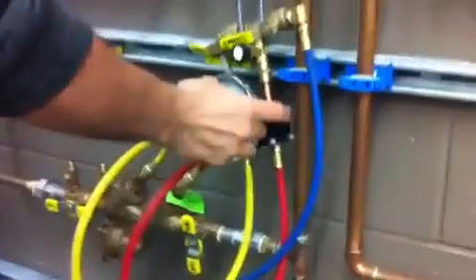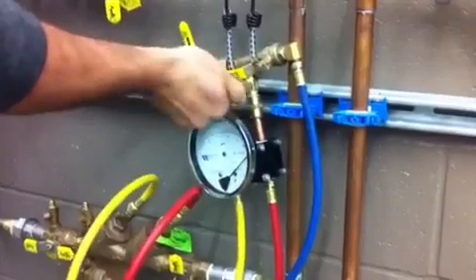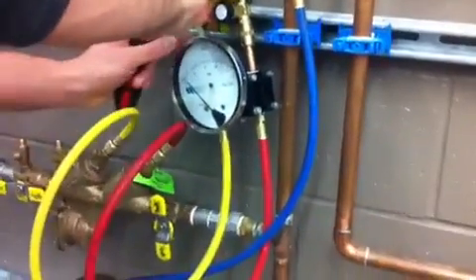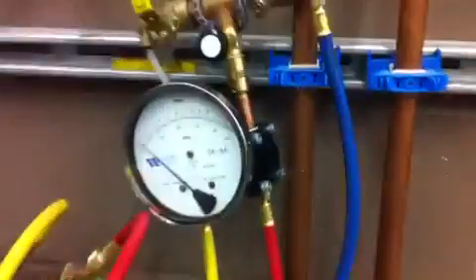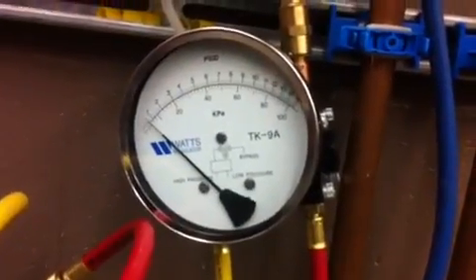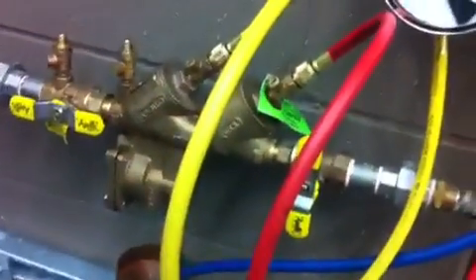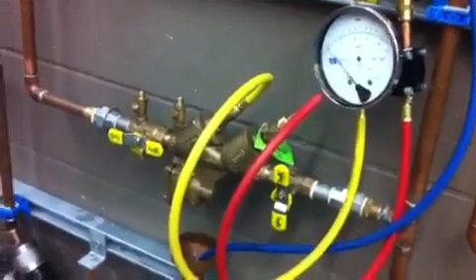Clean the air out of the gauge. Close high, close low, and close vent. We need a reading of 1 PSID or greater. As you can see, it's actually below — so this has failed and needs to be serviced. But for the remainder of the test, we'll assume it passed at 1 PSID or greater and continue.